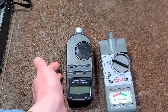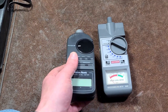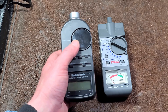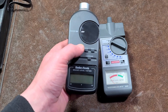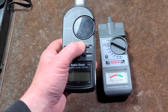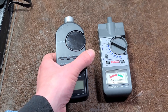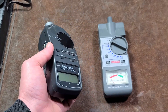That's why I still like analog sound level meters — they give you a better idea of absolute variation. However, there are other situations such as music or more consistent sound level testing, like measuring how loud it is to run an impact driver, where the digital ones are better because they're easier to use with minimum and maximum functions. Even though this does have a data hold function that prevents the needle from moving, digital ones have min, max, and data hold options.